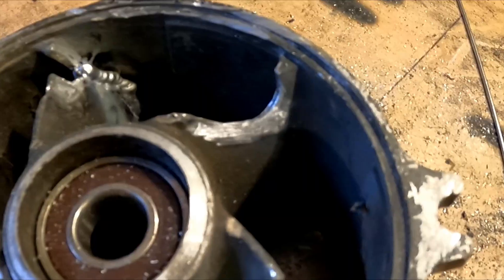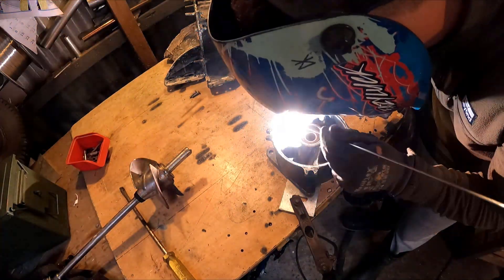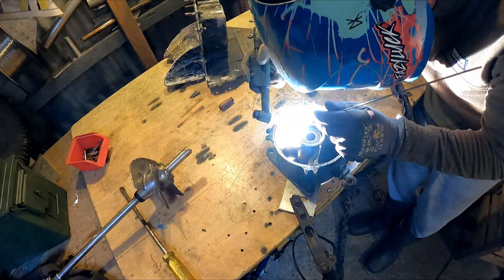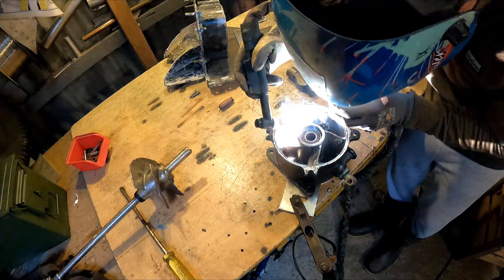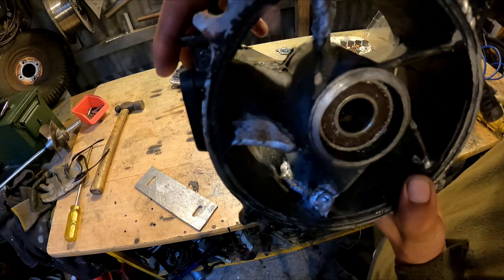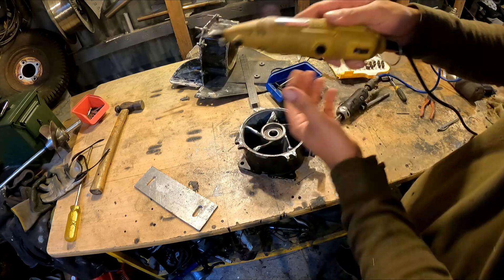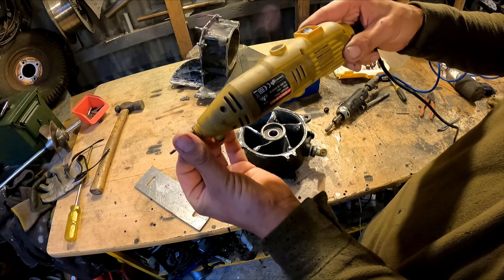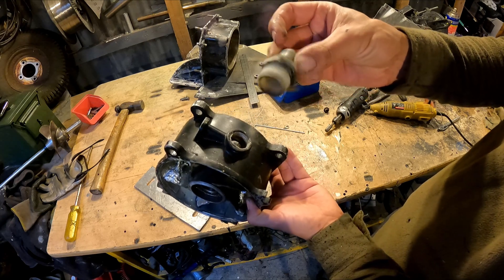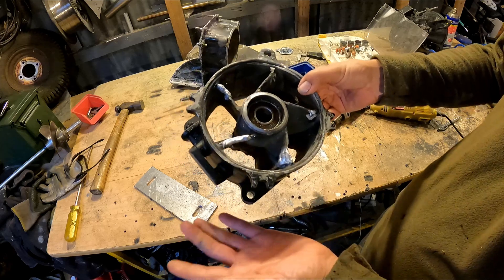I've got a horrendous weld either side of that fin now, which will make it strong again — I'll grind it off later. Now I've got to build this up with the TIG welder, dropping it back to about 75 amps. I've welded that off and started grinding down the welds, but my compressor can't keep up with the die grinder and the Dremel bits aren't aggressive enough. I'll finish this off at work. I'm also going to take out this half-inch BSP fitting and blank it off because I'm going to run a closed circuit — I need to run on land as well.